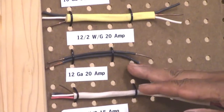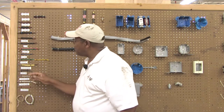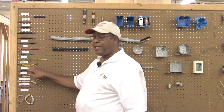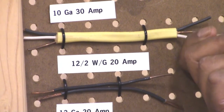From the 14-gauge wire we go up to number 12-gauge wire. Number 12-gauge wire will carry 20 amps in your home. The 20-amp circuit is usually for your refrigerator, your microwave, your garbage disposal — the heavier appliances that pull a heavier load will be on a number 12, which carries 20 amps. The number 12 I'm pointing to here is a single strand, and then right above it in yellow — yellow is the designation for number 12. When you buy Romex number 12, it's a yellow color, and it'll have 12-2 with the ground or 12-3 with the ground.